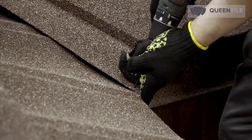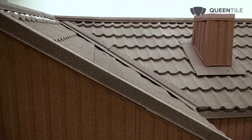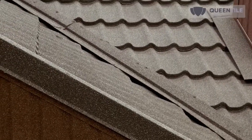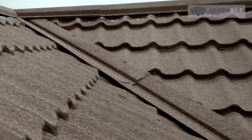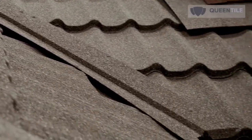It is very important for the laying to be straight; stretch threads for reference. The decorative valley provides aesthetic beauty and alignment for internal corners on the roof, and also prevents snow and debris from entering the inner valley. Overlapping of the flashings in the valley node shall be at least 100 mm.